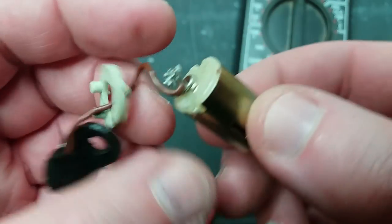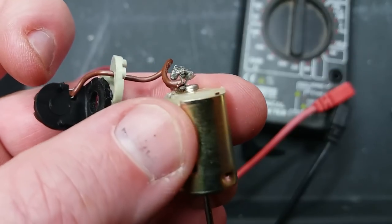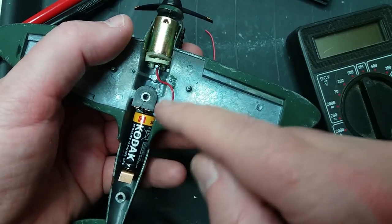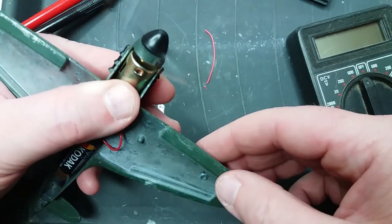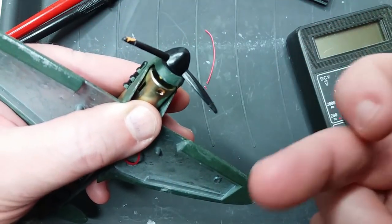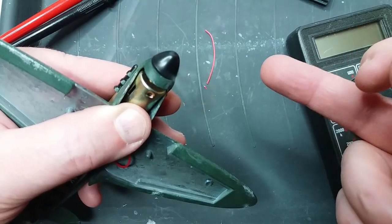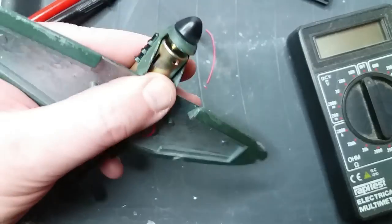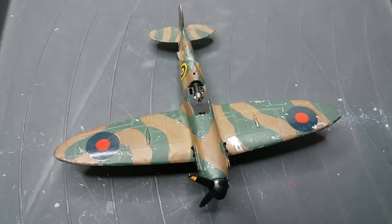The motor I think is working, but I had a look at this dodgy soldering and if you actually look, it's a dry joint — the wire isn't actually soldered to the terminal. It goes through the terminal and it's trapped by the blob of solder, but the terminal itself has not been properly soldered. So what I've done is cut that brown wire off, removed the blobby soldering, replaced it with a new wire, and done a slightly better soldering job. The motor is now running — all you do is stop it and start it.